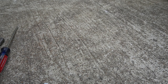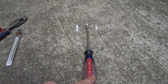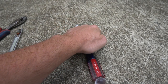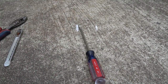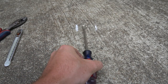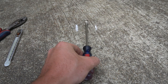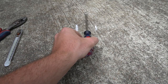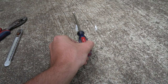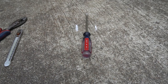So I'm gonna try to better explain what Ike was saying about different mounting positions for our steering rack. Let's say the screwdriver is our spindle. If it's mounted all the way out here and we only have a limited amount of steering room, AKA turns within the rack and pinion, we only get this much movement, a few degrees. I'm not gonna say that's very many. However, the closer inward we mount the steering on the spindle, the more radius we're gonna get with that same amount of movement. This is both gonna make the steering more sensitive and we're gonna get a tighter turning radius.